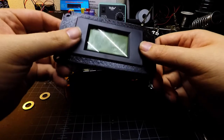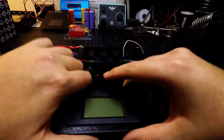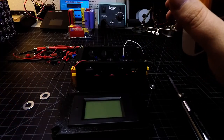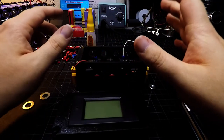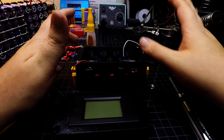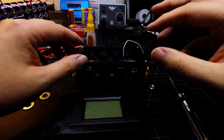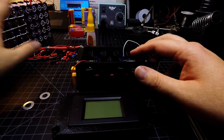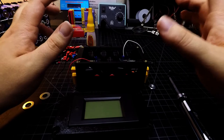You won't get to see it working in this video — maybe in the next one. Everything I've been doing today — the lights and soldering iron — has been operating off the mini power wall battery pack. It's been running great all day under a very light load, under 100 watts total: the soldering iron pulls 40 to 50 watts, the LED lamp about 10 watts, and the GoPro is charging right now. My entire desk setup has been running off the battery pack, which is cool — though recharging it will be off the AC mains, not renewable energy.